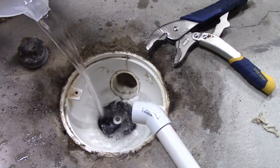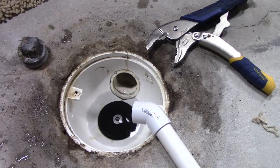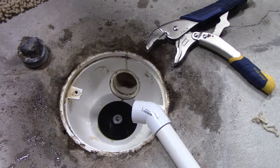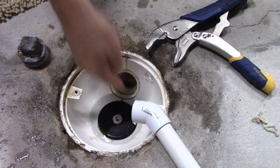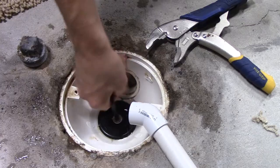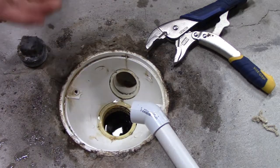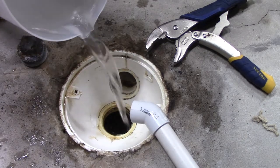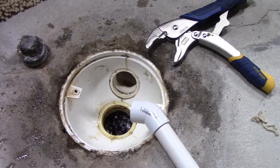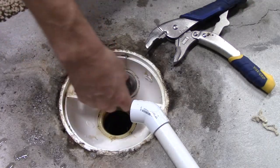Now when I pour water in here, we're going to see that the water stays at the bottom of the clean out hole and remains at that height. Even if you pretend there's no plug in here, it's going to do the same thing — stay right there. So if I see a drain where the water level is right at the bottom of the clean out hole, I know it has a clogged drain. But if I see a drain with a missing clean out plug and the water level is way down there, I may pour some water in to test it, and if the water stays at that low level I can feel pretty confident we have a properly functioning drain — and the fix would simply be to put the clean out plug back in place.